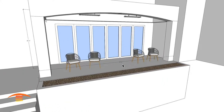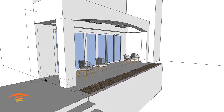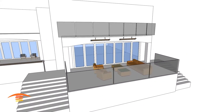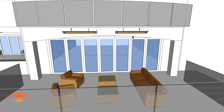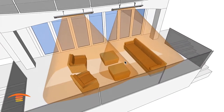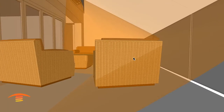Looking at the second section, we have 23 feet 6 by 10 feet 1 to the ceiling, with 8 feet 7 to this edge and 6 feet 8 to this edge here. With these 6000-watt units at 8-foot centers from each other, I'm able to cast the heat ray out and have acceptable overlap in the center, covering this portion of the patio out to about this position here where it penetrates the chairs.